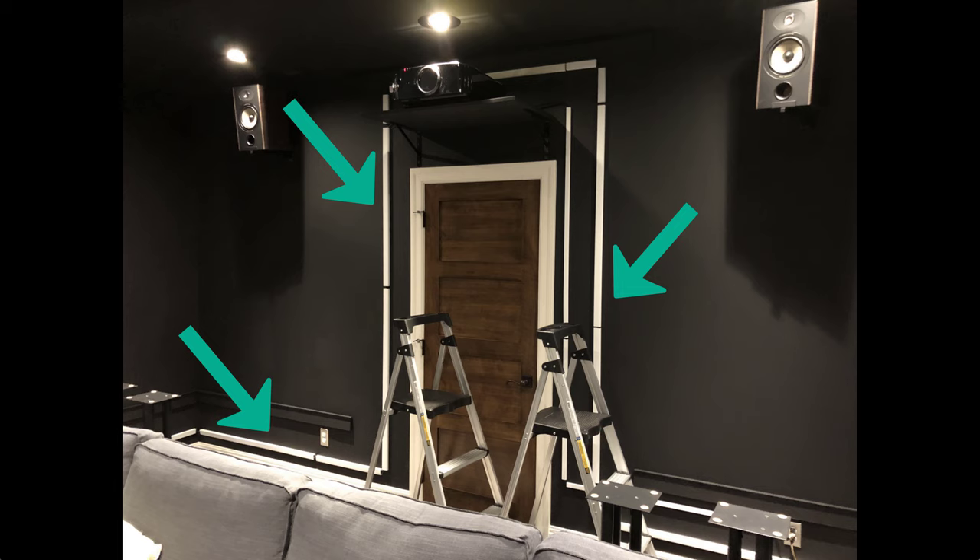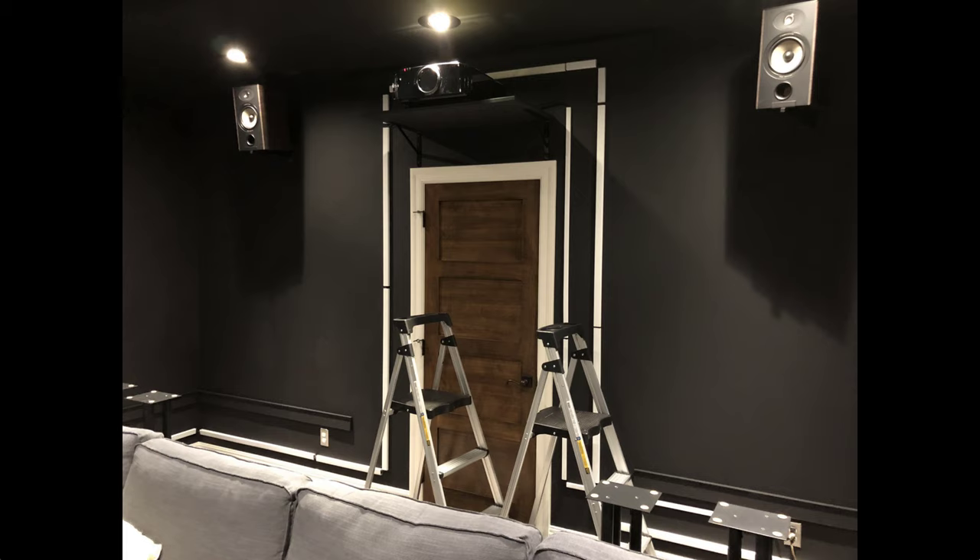What I conceived of was surface mounting cables in clean-looking channels, but in a way that remained accessible and hidden — enter the curtain skirts. By mounting the curtains to cover the lower portions of the walls and the vertical portions where cables needed to go up and over things, I was able to use stick-on plastic channels from Home Depot behind all the curtains. This could generally get me everywhere in the room I needed to go for the projector, the subwoofers, and all the speakers, even getting up and over the closet door behind me in the back of the room that's fully curtained over. The closet still remains accessible too if I need it.